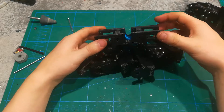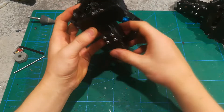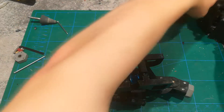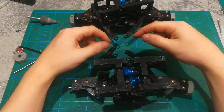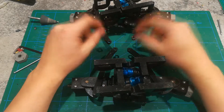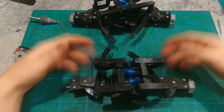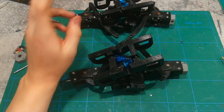Let's take a look at this secondary axle. As you can see, there's the notch right there for the driveshaft. This is essentially identical to the front set of axles over there, except the side of these is inverted. These ones would face in this sort of orientation, where the steering linkages come together and are driven by two different sets of linkages. For that reason, you actually have to mirror these parts on the second axle. Now that we have all the axles completed and the transfer case, we can move on to the steering, which is the next video.